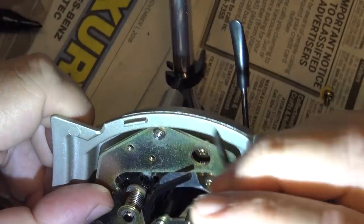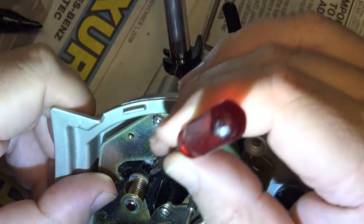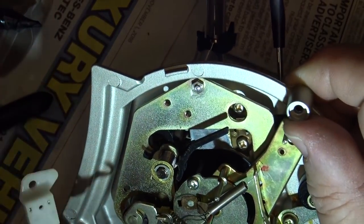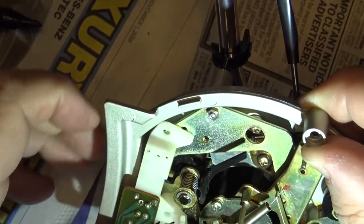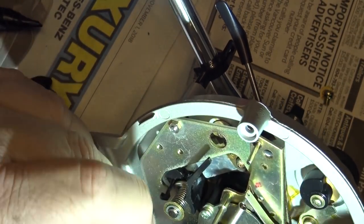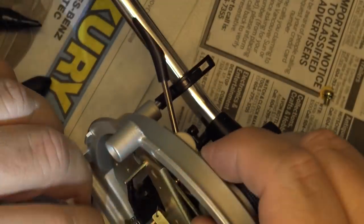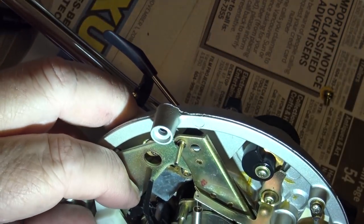Anyway, I thought the camera was running, but it wasn't. But this lever was broken, and you can see where I fused it back together. Let me put the switch back together. This little claw here has to go into the side of the switch. This is what mutes the sound. You'll see that there's a switch here, and a little piece that this claw fits into.